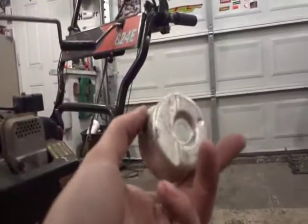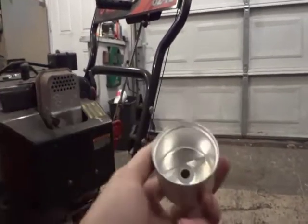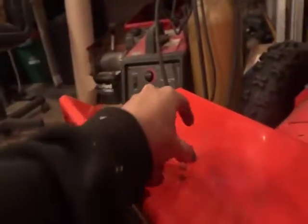See how this guy's got a little bit of an indentation on it? Every carburetor bowl is going to have it. You want this part here to be where your fuel dumps in at. So my float right here is dangling down. I'm going to take it and put the shallow end to where the jet is. And there you go. Bolt your carburetor on, and you bolt your little jet on right there, and you're good to go. Just like that.